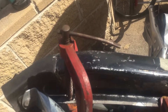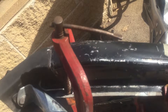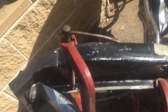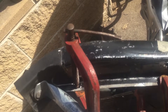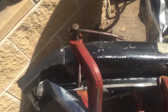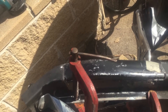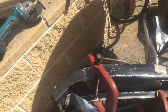Now it will fit. It's just a matter of going along and welding it back up where those relief cuts are, then grinding it down, sandblasting the inside of the rails, and painting it. Then I'll weld that in and it'll come out looking quite nice.